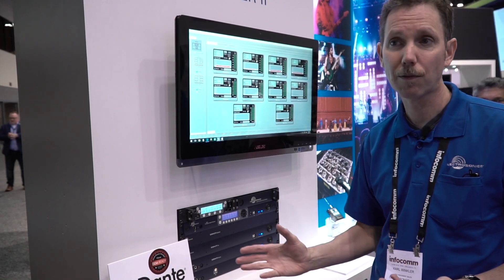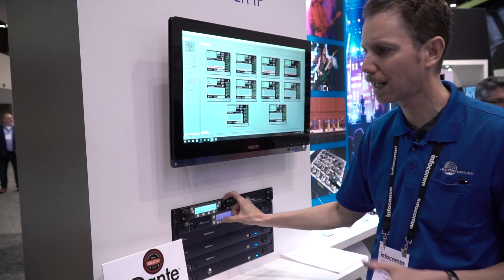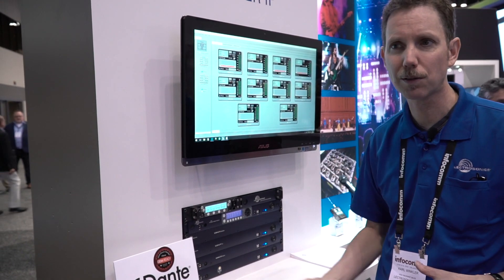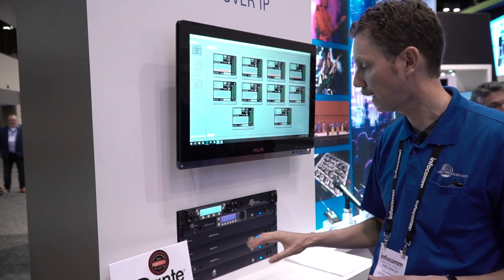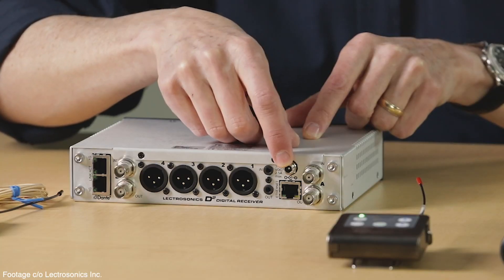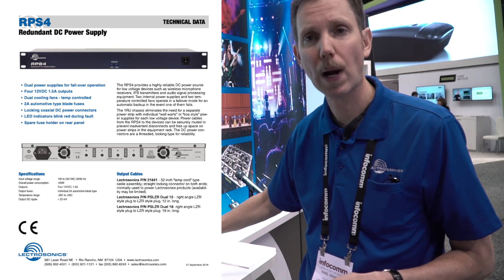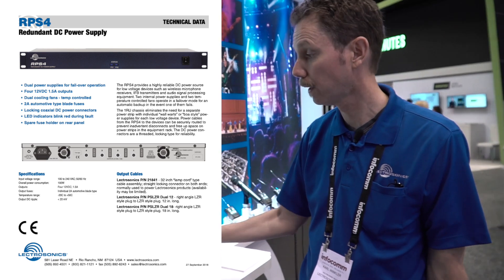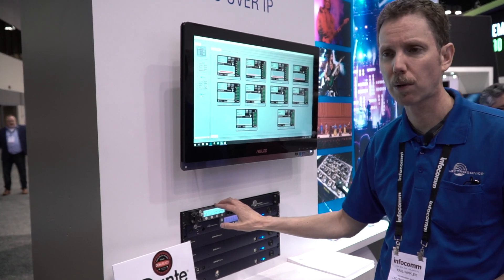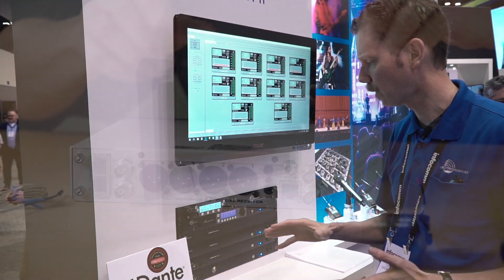To your question about who it's aimed at — really it's aimed at a wide variety of users. Being a rack unit, it's probably not destined to be a camera mount receiver, but from there I see bag users using this system — we've already seen that on social media. As a rack unit in a studio, a TV studio, a church, on a tour — this is 12-volt DC powered, so you can power it off a central DC system. We make power supplies like a rack redundant power supply called the RPS4, so really any way you can get 12 volts into it and enough current, it'll work.